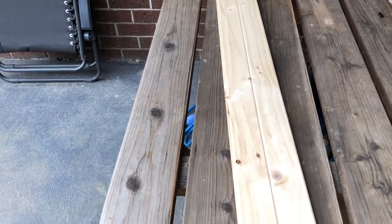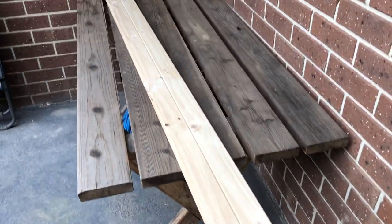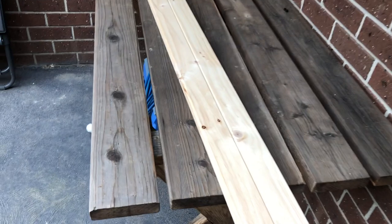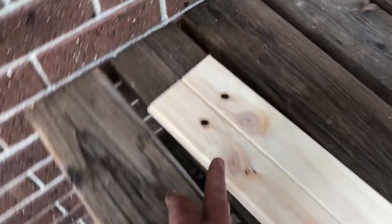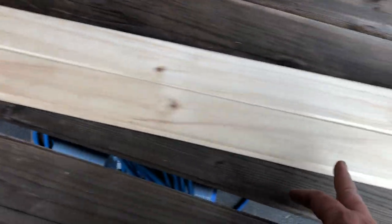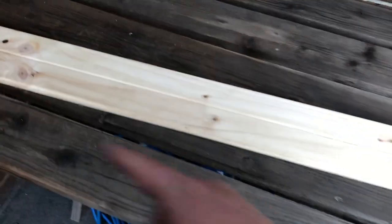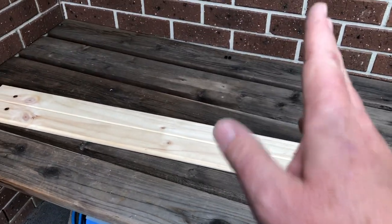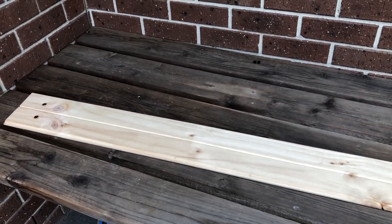This will need to be stained to come to the right colour, but the whole spar here needs to be done, so that's fine. When you've got a panel board like this — it's pine, it's pretty easy to work with — all we need to do is cut this into lengths, accurately mark and cut these, and then we can tongue and groove them together and very quickly make ourselves a board. We'll put some framing on the back and be able to sit it into place.